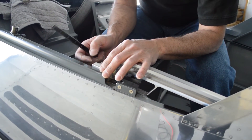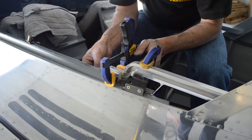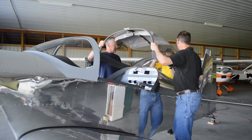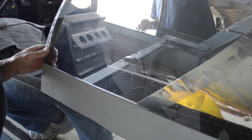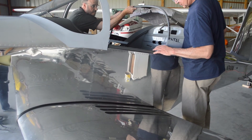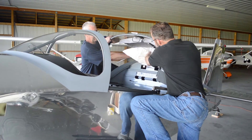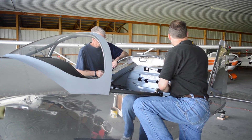Repeat all of this on the other side. If the marks you made for the canopy rollers earlier weren't in line with one another, which is common, you'll need to adjust the second track forward to accommodate for this discrepancy. When you get this side placed appropriately and clamped, it's a good idea to put the canopy back on and carefully test everything together. You want to make sure that the rollers enter the S-Tracks smoothly, and that both sides of the canopy ascend and descend the vertical portion of the S-Tracks as close to simultaneously as possible. Once you're satisfied, you can disconnect the canopy from the trucks and remove it, or simply slide it back and set it on a thick pillow or other cushion on the turtle deck.